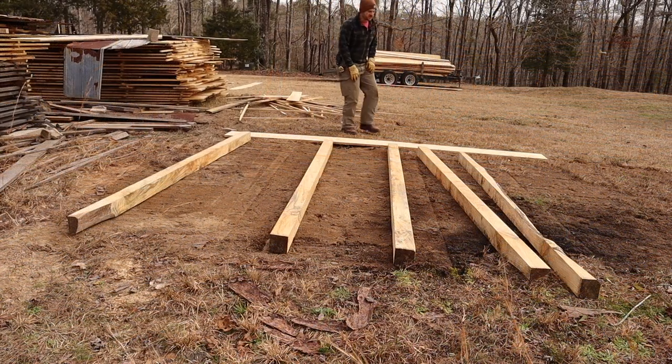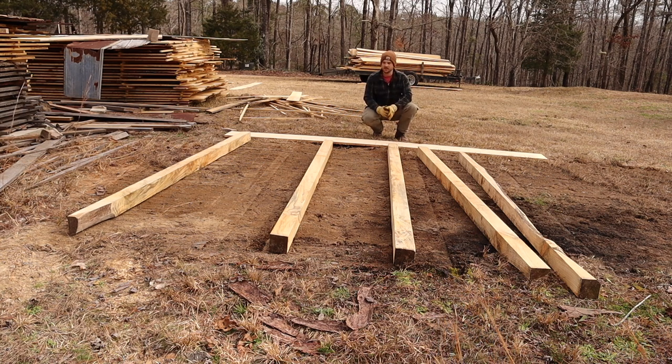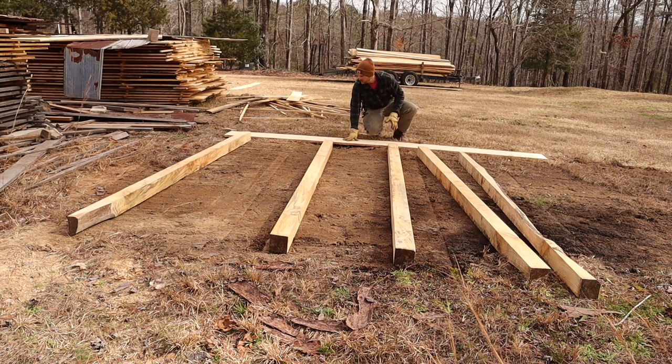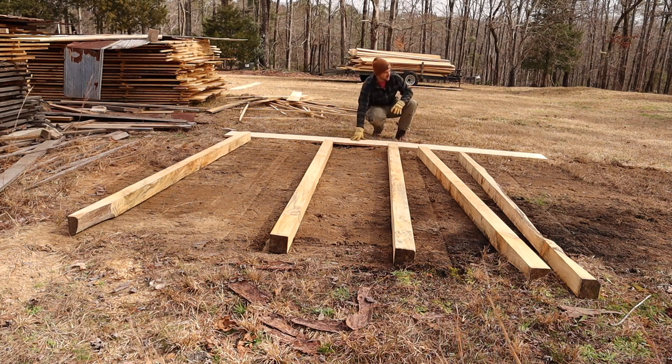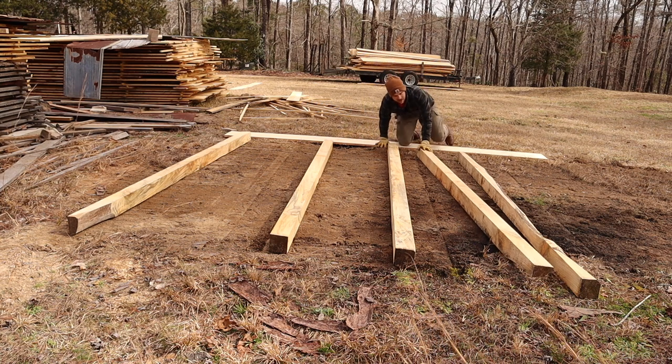So I think the rule of thumb is you need a sticker every 2 feet for support. You can actually get away with a little bit more than that. I think the ones I'm doing here are going to end up being something like 2 feet and 6 inches apart. What I've done here is I've laid out one of our boards. This one's just slightly shorter than the one we measured earlier. And I'm just going to space these timbers